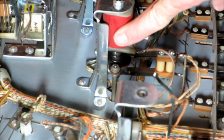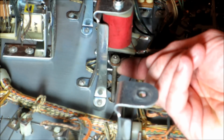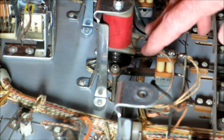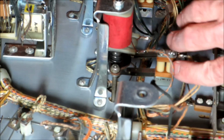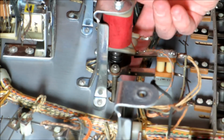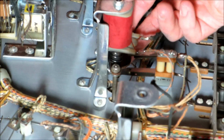So this is a pop bumper upside down. Remember that pop bumper ring is going to push down against the play field, which pushes those balls away. And what I wanted to show here is obviously there's a coil, two wires coming in, but there's a switch right here. Actually, there are two switches. Remember I mentioned that when the ball runs up on an apron, there's a little switch in here called the spoon switch that the apron moves around and closes the spoon switch. Hopefully you can see, just watch right here as it moves. It closes the switch. When that switch closes, it fires the pop bumper.